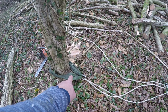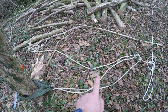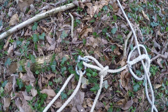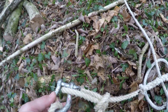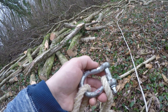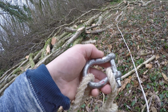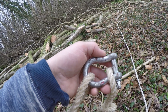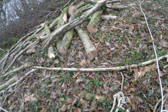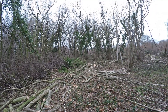That carabiner came out of the road several years ago, so it now wouldn't pass a LOLER test because they have dates on them. The rope wouldn't pass. The carabiner was from a car boot sale — a quid — it's a steel one, actually marked, not a cheap one: 500 kilograms. There's no way I can pull 500 times 2.2 pounds, so that's well within its limit. And the same with the strop. So, felling with rope assist and a three-to-one advantage.